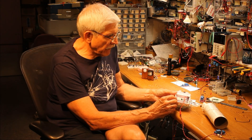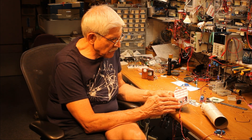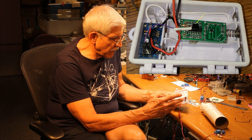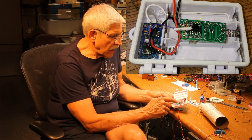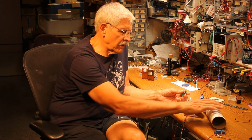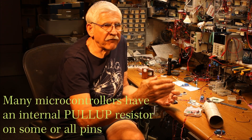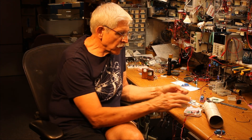Here is the microwave sensor board inside a plastic box, with the circuit that came with the lights to change the modes. I just have five volts going in to power everything, and a connection between the button pin on the control board and a slightly modified output pin on the sensor. This device — the blinking lights and many other button devices — works by sensing a pin taken to ground. The pin is internally pulled high by the microcontroller, and as soon as you pull that pin to ground, it senses that.